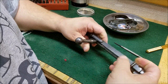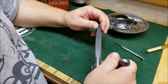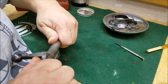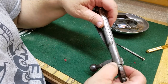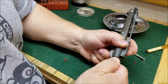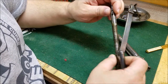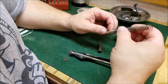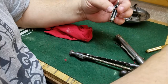Now it's time to pull the bolt apart and clean it up. When I'm trying to put it back in the gun it always wants to override. When you've got it out of the gun it rests in a little notch, but to take it apart you pull it out, twist it and pull it some more, push it all the way over and it will come out. There's a lot of old oil and stuff on there — it feels like old motor oil, which wouldn't surprise me; that was pretty common back in the day.